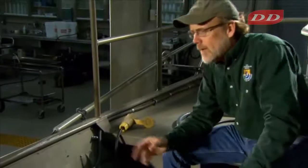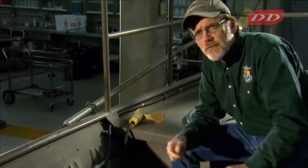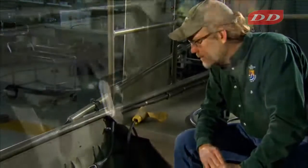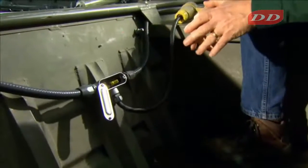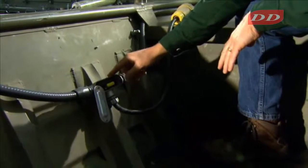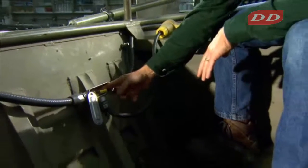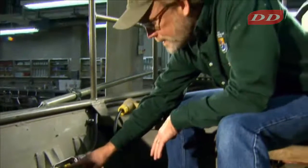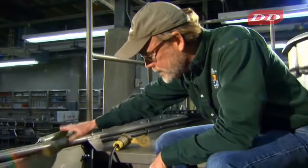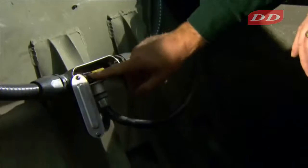And we use the flexible conduit so that the conductors, the wires, are protected from abrasion, from the weather, and that sort of thing. It's just a safer, drier environment for the electricity to be in. Any splices in the wires need to be made inside watertight conduits. So in this case, we have the anodic line coming through, and we have a splice in the wire here to have a branch line going out here to one boom. And we use a wire nut inside a conduit.